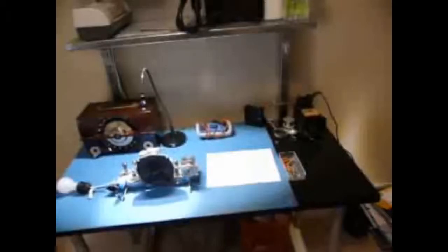These are small assembly tables. What I like very much about this bench is the way he has arranged his lighting. Sufficient light is very important when working on small devices. He has fitted a tube light just beneath the shelf, giving him a bright workspace even though the room has no windows. His soldering iron is on the right, and he has a small table lamp for high-intensity work right in front of him. He also has a small DC fan to blow away the toxic fumes produced when soldering.